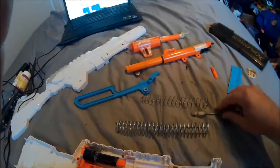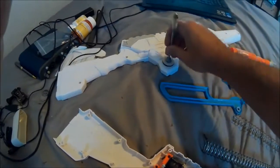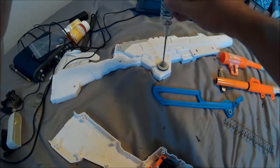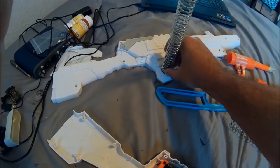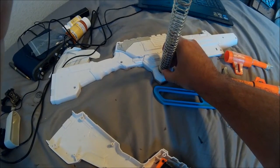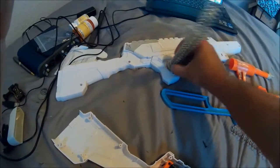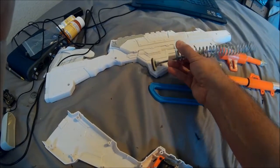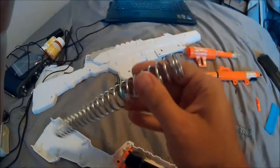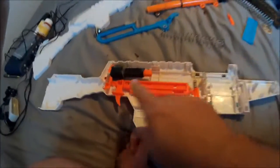But how are you keeping it intact? Well, one reason is, when the spring rests against here, take a good look, it's flat. There are no stress points hitting the plunger head, except for the force of the spring. It's spread out more uniformly if you flatten your spring coils. And once you go to really big spring coils, you really have to do this.